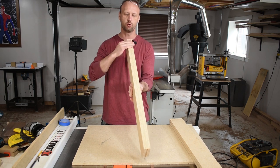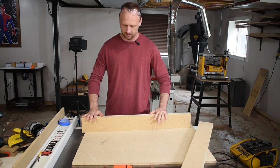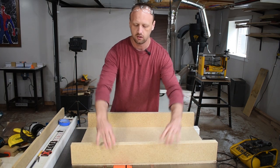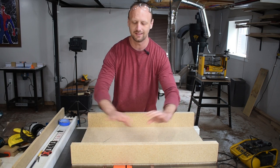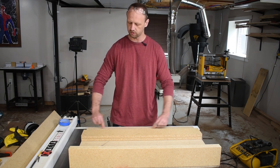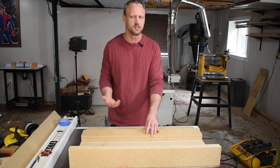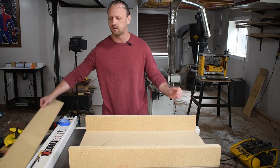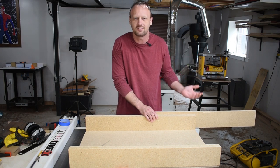I took some time to run the fence over the jointer so I can make sure the surface is nice and flat, so when it sits on my bottom panel everything is going to be square. I'm going to simply screw in the front fence and back fence — the back one doesn't matter much, that's just for stability. For the fence closest to me, I'm going to make a mark about three-quarters of an inch all the way across, because I do all my crosscutting right here at the table saw. I'll clamp a board onto my fence and use stop blocks. I'll align my fence with that mark, put a screw underneath up into my fence on both corners, and then run it across the blade to make my kerf.